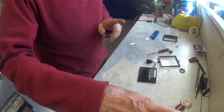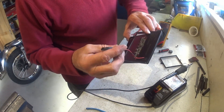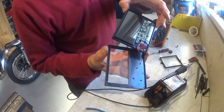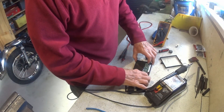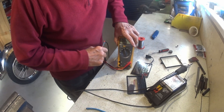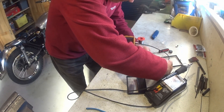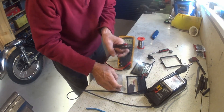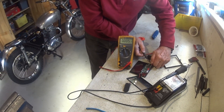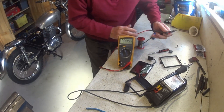We're all soldered up — did I forget to put the wires through first before I soldered it? Yes I did, so I had to unsolder it and go again. But wires through the small hole drilled, and I'll just check it. The meters are on DC voltage this time, not Hertz. Positive and negative — 3.2 volts. I'm just wondering if there are any capacitors on there, but when it's off it's off, and when it's on you get the three volts.